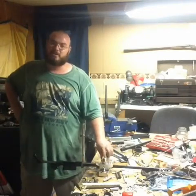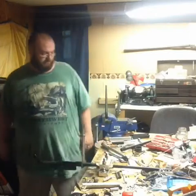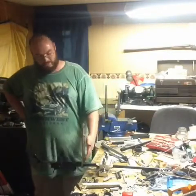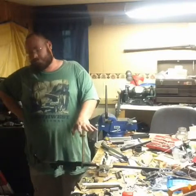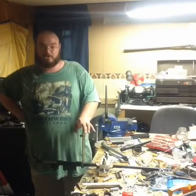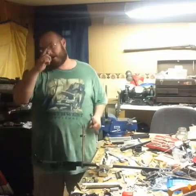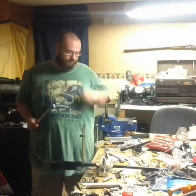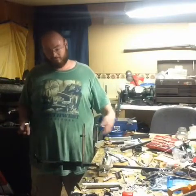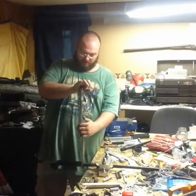Okay, so you put your piece of leather in this vise block, and you tighten it down hard against that leather so it doesn't move. Now the barrel nut is on there from the factory at about 75 foot-pounds, and that takes a lot to break it loose on the first try. But I've rebarreled this one with an ER Shaw, and whenever I rebarreled it, I put it at 35 foot-pounds. The recommendation on them is between 30 and 40 foot-pounds. So I put 35, just go with the middle, right? So it doesn't take nothing at all to break it loose.